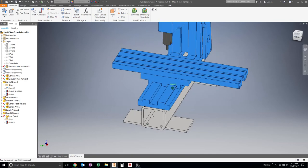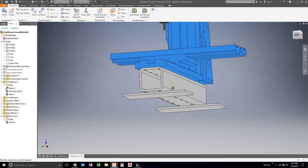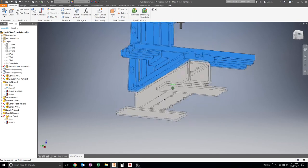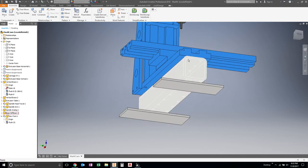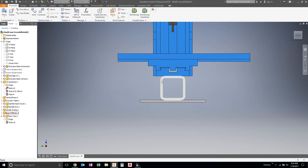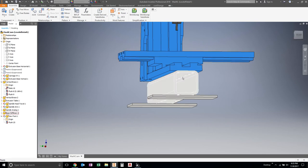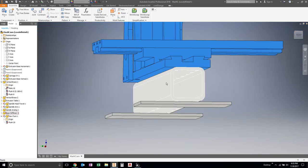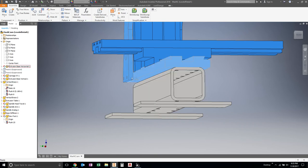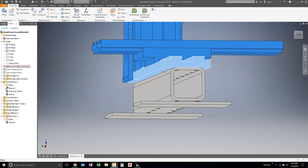Well, crap, I'm not even sure how I would do that, because I can't really fill it with sand or epoxy or anything, because I got to get at these bolt holes, these bolts up here. So maybe the thing to do then, if this acts like a giant resonance chamber and is gonging every time I go and hit some steel with the bit, is to just get a 4-inch by 16-inch by whatever and drill and tap holes into it and have that act as the base plate and just shim.